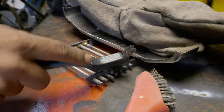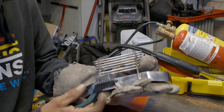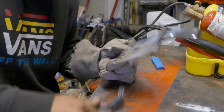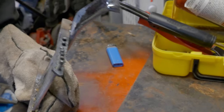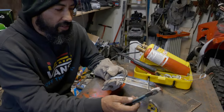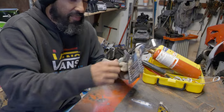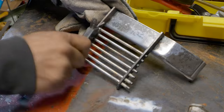Two little flat stock — I think this is eighth by half inch. I kind of clamped them together and used the grinder and made them both identical, the same. Kept them clamped the whole entire time after that. Punched all the holes, all perfect. This is brake line — it's hollow. I don't think they're real solid steel on a semi, so I kind of want to keep it hollow. I picked this up at your local automotive store. They sell it in rings and spools sometimes, but that's a pain to work with. Some places sell it in strips — if you get it in a long straight strip, it's a lot easier.